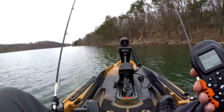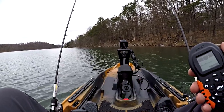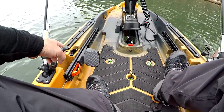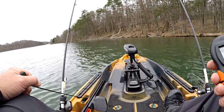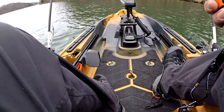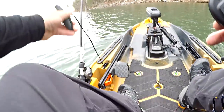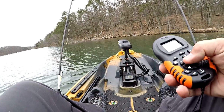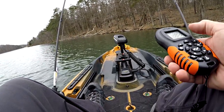Just like that. You wanna make sure your blades and the positioning of your trolling motor is in the right position. So line up those red arrows, because all you have to do next is just grab that, bring it on back down. And there's a little red spot right there that connects the electricity basically, and all you're gonna do is lock that in place. And once you lock that down like so, you drop that cord in that little compartment and you're again raring to go. So let's get that thing back up and running, and we're on our way.